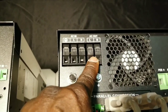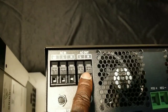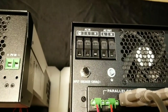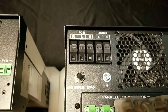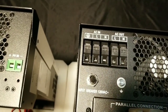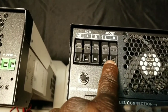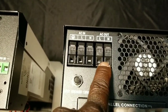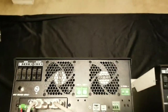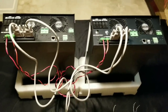If you have a sub-panel and you want to power your house, this one goes to one side. You have to buy a disconnect box or breaker box — you can use a 100-amp breaker box with a breaker so you can disconnect the entire circuit. This one is going to go to a 240 breaker box, and this one is going to the other place, so you can pull loads the way houses are wired.